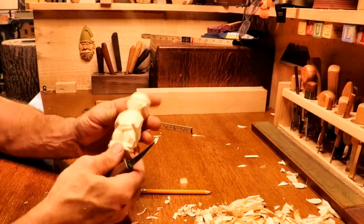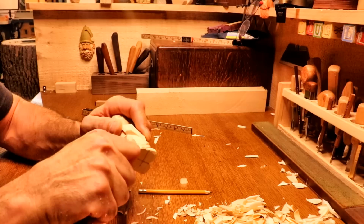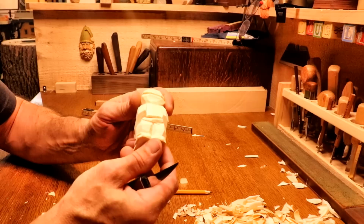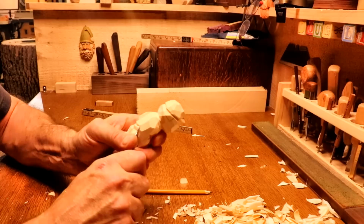And now, again with that cut, so I got that sweater, I'm gonna go do a deeper cut and just get that little shadow under there. See the little sliver I'm taking out? It's just a whisper, but now I got a little dark line underneath there. It gives you that shadow and a good paint line. Take the corner out.